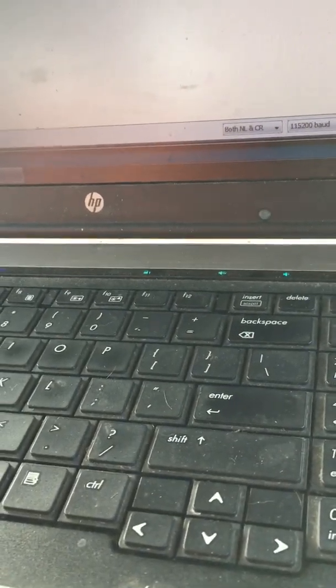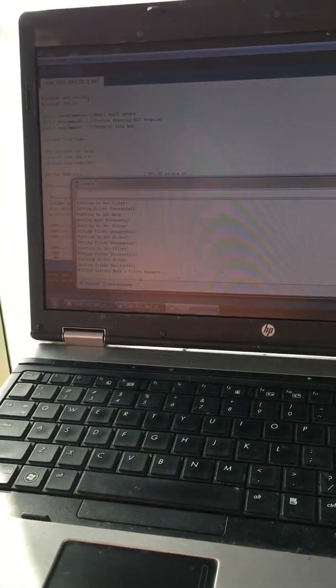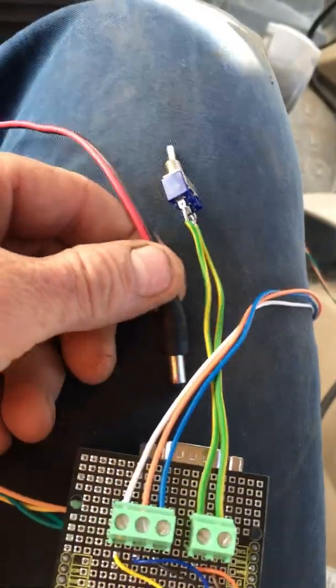So now if we start the tractor, we still don't get any messages because there's no navigation controller to send anything, and we haven't told the tractor it's there, so it just carries on. So now if we boot our navigation controller up with some power, that CAN bus bursts into life.